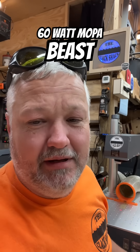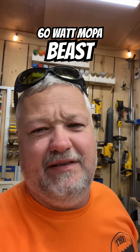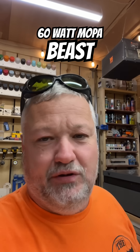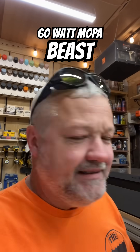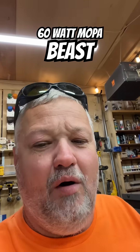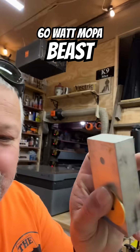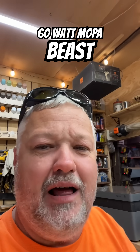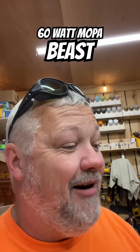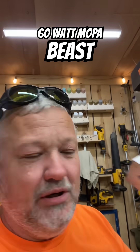The second thing I did was take a brass coin — I wanted to see how deep I could go. Everybody always says it takes about 250 passes to get a decent relief on a brass coin, so I set up an engrave on a little 10-millimeter circle using settings I thought would work and set it for 250 passes. Yeah — bit much, guys. I went all the way through the coin and probably a good half mil, maybe three-quarters of a mil, into my little aluminum protective block that I put under it.